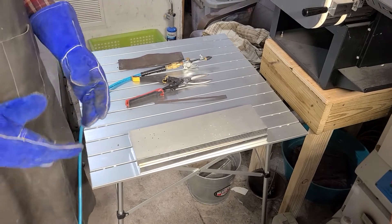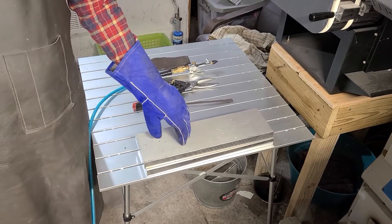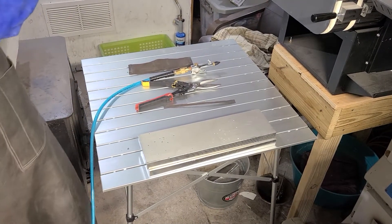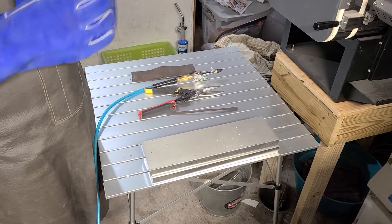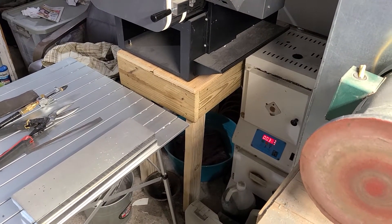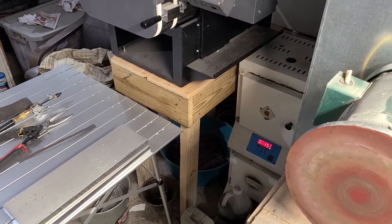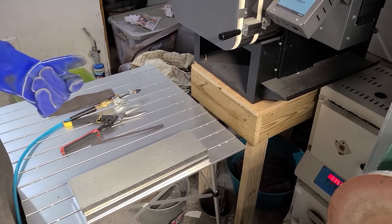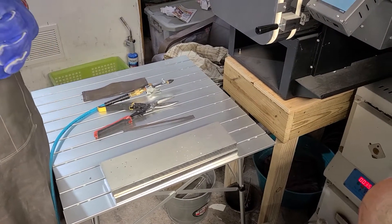The next step, once this gets down to room temperature, we stick it in the liquid nitrogen. That will hold in liquid nitrogen for about 30 minutes to an hour. And then we stick it in one of these little ovens here — they're actually enameling kilns, but I use them for tempering my knives because they get a really good steady temperature. You hold it in those for about two hours and you repeat it anywhere between two and four times. I like to do three cycles.